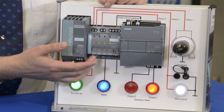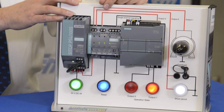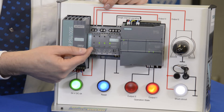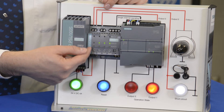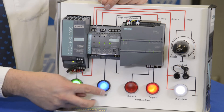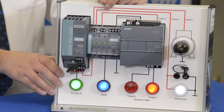As soon as this circuit resets itself, finding that the overload in the motor has in fact cleared, we can actually reset that circuit either locally using this push button where the red flashing LED is, or we can wire up an optional remote reset and start that motor without ever going inside the panel.